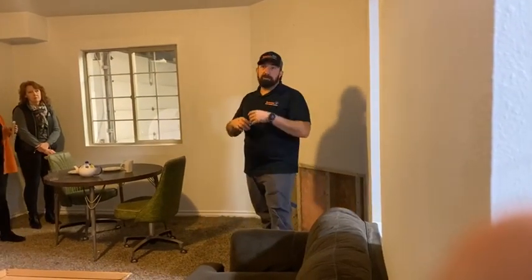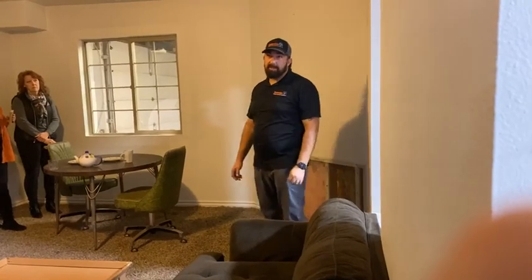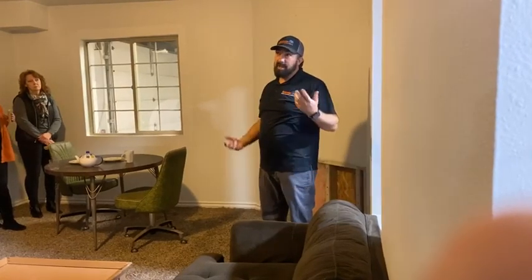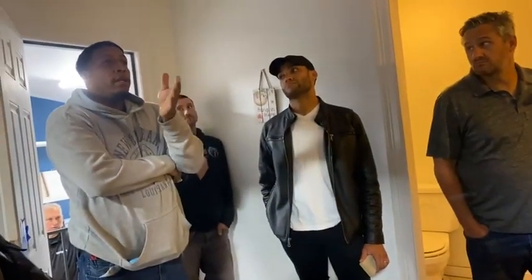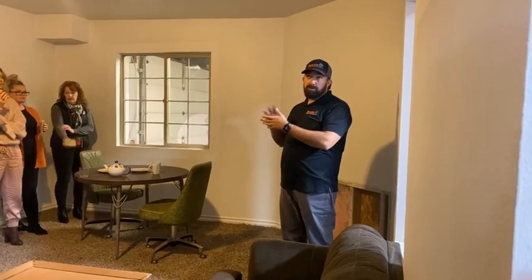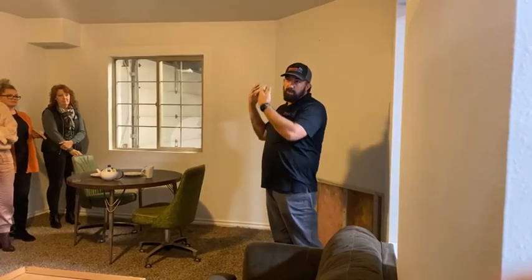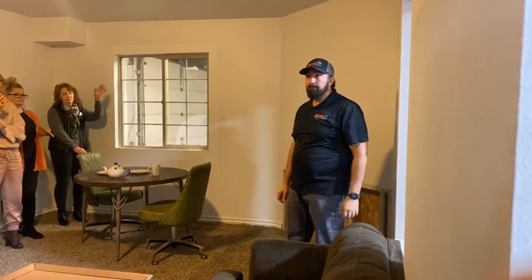Yep. Now, if there's damage beyond repair, then we have to start pulling roofs and trusses and beams and stuff like that. House fires typically go upwards, and so roofs are usually one of the things that don't get salvaged. Those are usually replaced. Do you have to pull permits to cut certain rafters? Yeah, you've got to get an engineering report, which we usually call these guys here. They'll tell us which trusses are salvageable and which are not. Because we're general contractors as well, we pull permits, pull the damaged rafters off, put the new rafters in, new OSB, new shingles, and put a new roof on it.